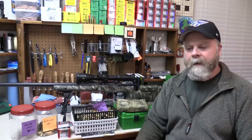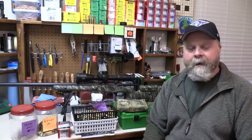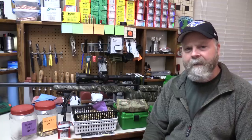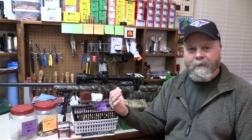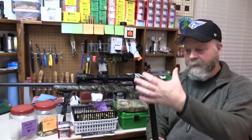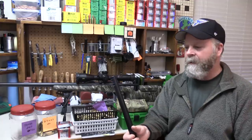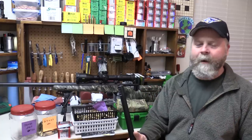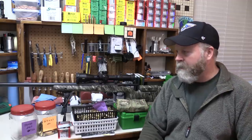One of the things I got asked a lot about was the barrel. This barrel is a Krieger heavy varmint contour — I think they call it a number 17. It comes ready to be finished at 28 inches; I finished mine at 26 inches. The muzzle brake is a Defensive Edge four-port. It starts out as a one-inch brake that has to be fitted by a gunsmith or somebody with a lathe, and then I contour it down to the end of the barrel. These little four-port brakes work great on these 6.5 cartridges — hardly any recoil. If you're interested in one, just go to DefensiveEdge.net.